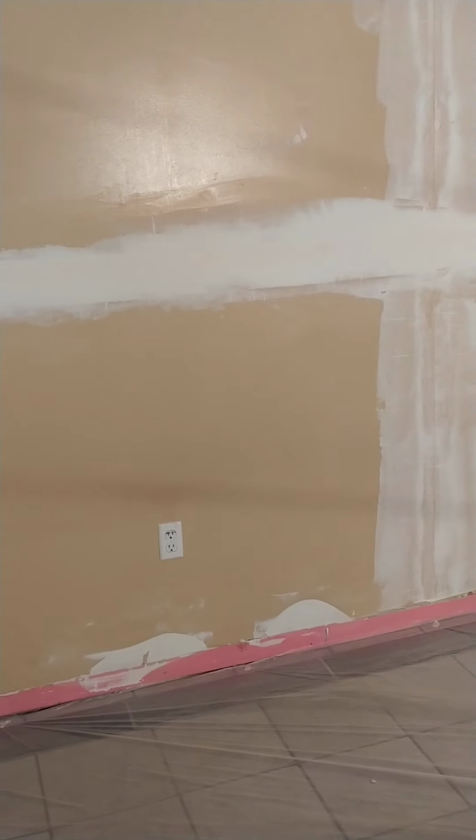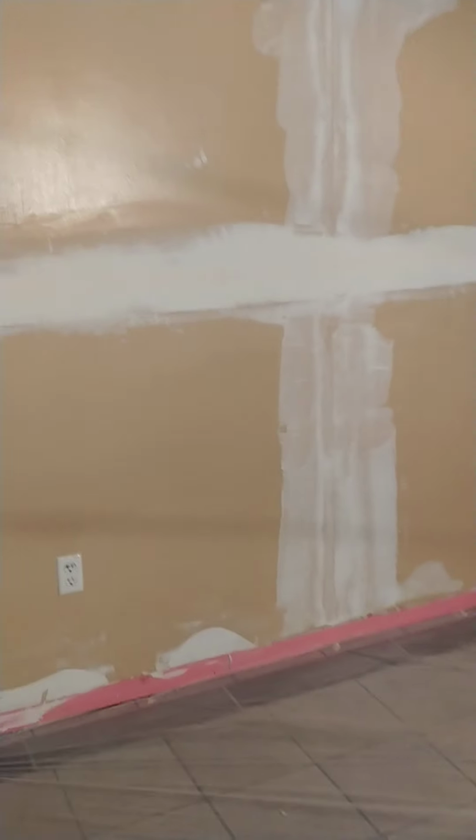And then the doorway over here, I'll cover that with plastic so that that vapor doesn't enter into the rest of the house. I'll use hot mud along the top end of the ceiling here. And I have the block sand the joints. They're pretty close, but there's still some low spots, and then we need painter's caulking on all of the moldings. And let's see what else. My hot mud will be 5-minute, and then all-purpose will get mixed to create the texture. The texture will be orange peel on the walls and a knockdown kind of medium texture on the ceiling. So I'll spray it and then I'll knock it down.